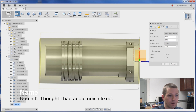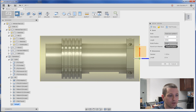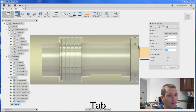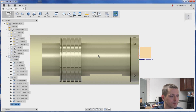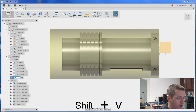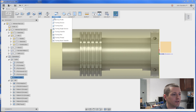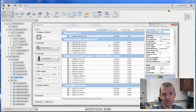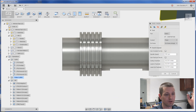See how right now it says model position centered — I don't like that. I want to offset it from the front, but we'll leave say 10 thou that will come in right there and clean it up with a facing op. So we'll call it Video Lathe. Turning face — for us it's tool seven, it's a standard Tormach turning tool polish insert. Looks beautiful.